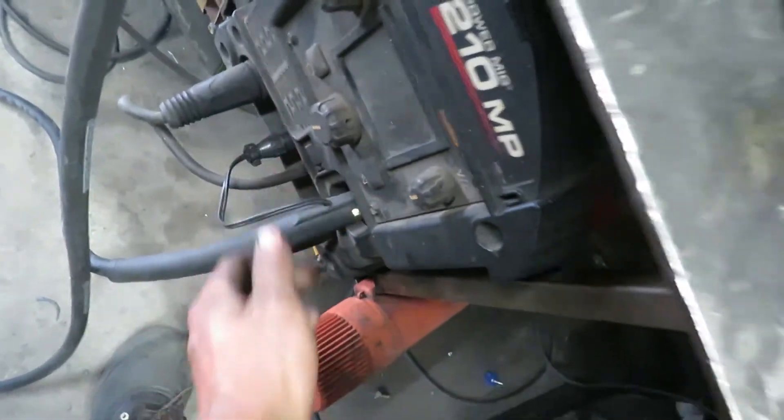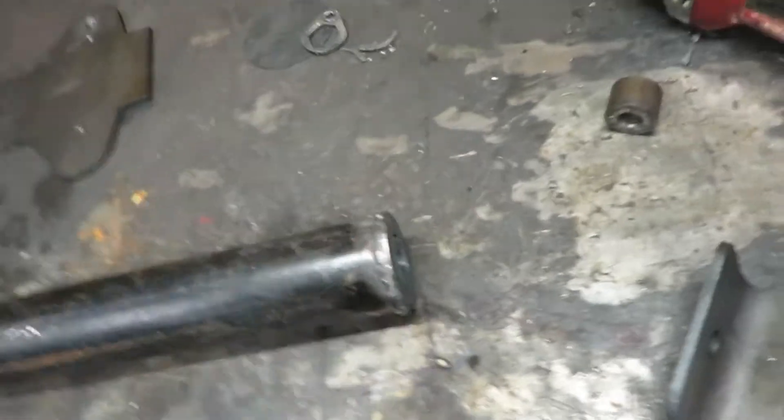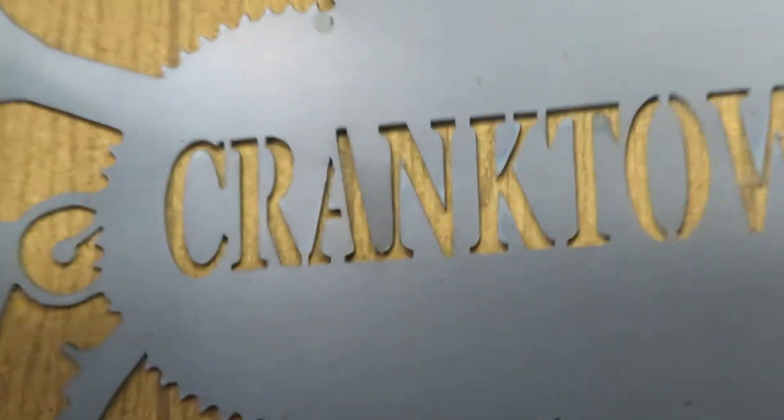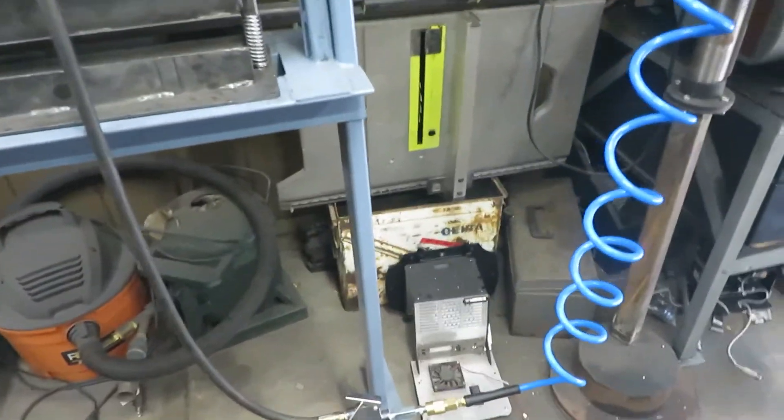I realized in my original design I did not take into account the crank — you'd think I'd think of that first. I'd rather have the crank on these two bottom rollers than the top so I don't have to make a notch along here for it. I think I've left this center punch undrilled, so I'll drill this out to accept one of these bushings.